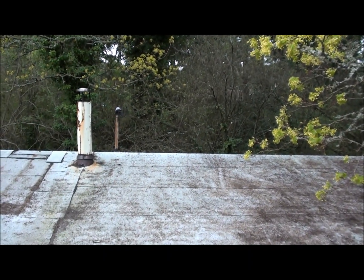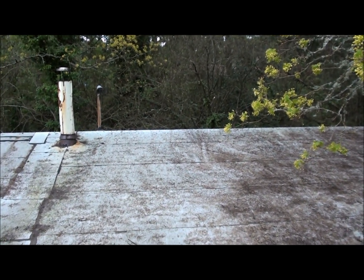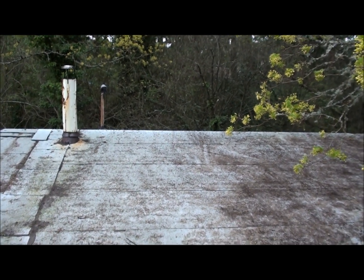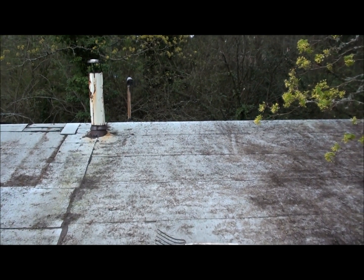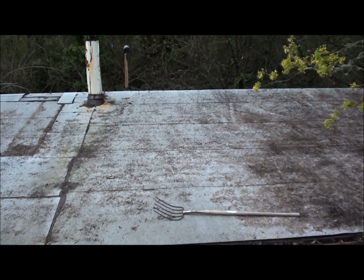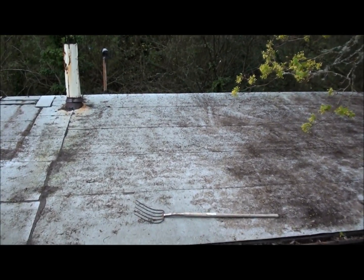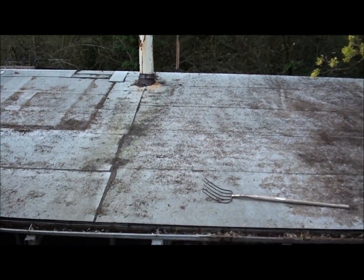Then up on the peak there, I basically glued about a foot on each side, and laid my paper up over the top there. So the top of that's just glued down. And then I'll do the same thing. I'll start on this side and lay it up over the top and work my way down. Or actually, I'll work from the bottom up, but it'll be laying up over the top by a good foot when I get there. Everything tarred down so it don't leak.